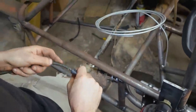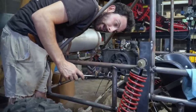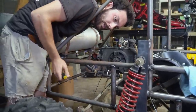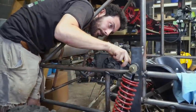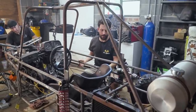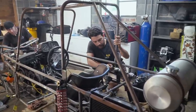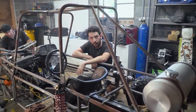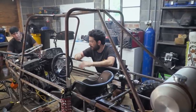This hard line just needs to get fastened to the frame, and then I can run our return line and our pressure or inlet up to the engine. We've got a T here which is a little janky, but it'll be fine. T's going to go down under like that and the inlet is going to match it. The fuel return line is completely plumbed up. Now I'm just working on the line that goes to the injectors. I've got it bent and I'm just going to hook it up with the fuel pump here, then go around to the front, bend it, and line it up with the factory hose. Fuel system will be done other than wiring the fuel pump.